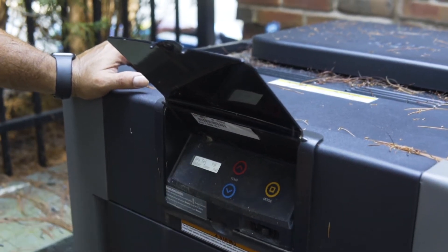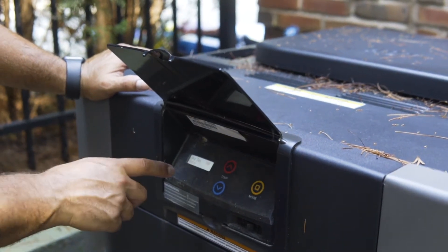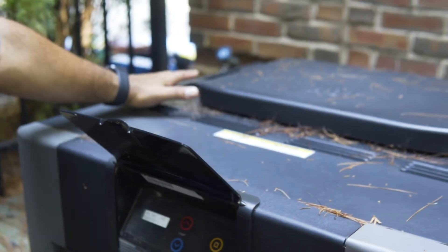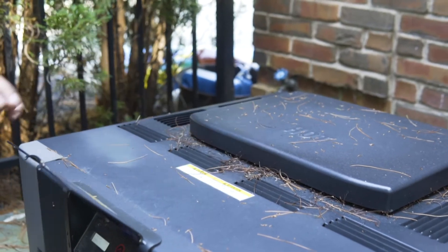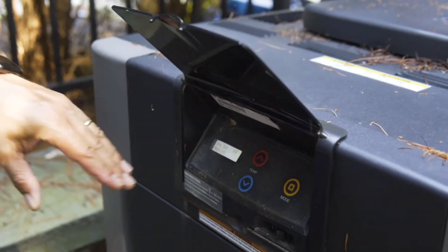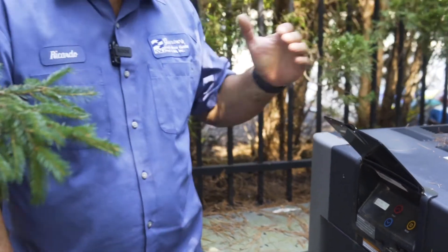Now reading 84 — just wait for the heater to turn on. You will hear the click and you will see the flame; it says sparking now, and in a little bit this will kick on. So now the heater is on; you can feel the heat and you see the water over here hitting the pool. The water is 84, and in case you have a spa set for 99, when it reaches 99 the heater will automatically stop. And if it drops one degree, it will kick on again automatically.